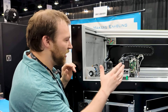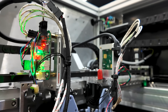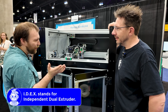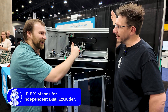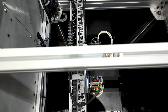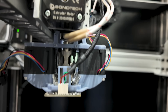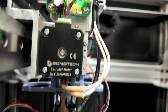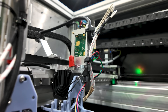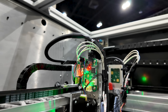Starting off, the main components are really the tool head. The StableBot Pro is actually an IDEX machine, or IDEX capable. You could have one tool head if you really wanted, but who wants that? People still love the IDEX. The reason people really want IDEX is so they can have two separate materials that are wildly different, or soluble supports when printing geometries that are impossible to support traditionally, or they want a nice smooth surface. The simplest example is PETG and PLA — they don't mix, they don't adhere, and you can build whatever you want.